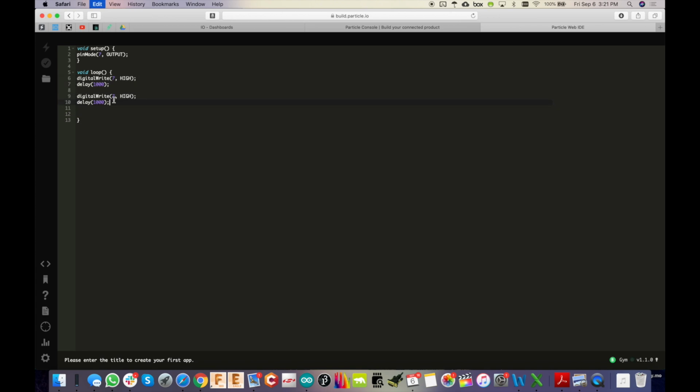Copy that, and then just to kind of flash it, give us a little hello world. And when you want to flash it, make sure that you click this, give it a name, click this save here. So it's testsketch.ino. So it's very Arduino-like, which I like. It's nice and easy to work with. It's familiar. And then we can verify it, make sure that it compiles.